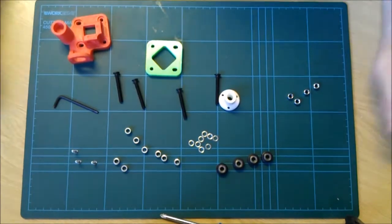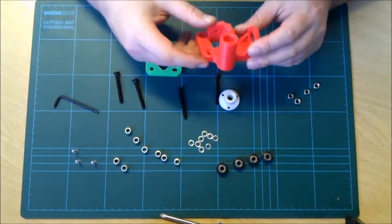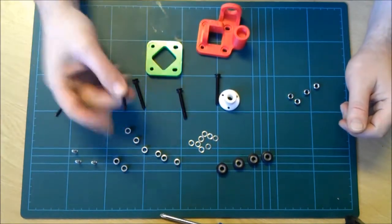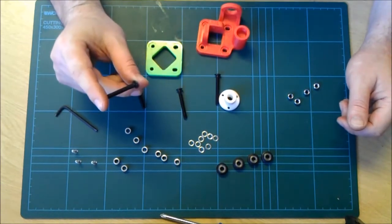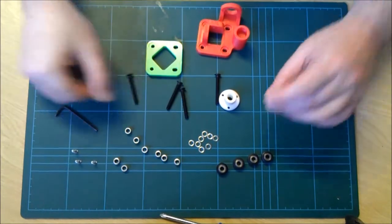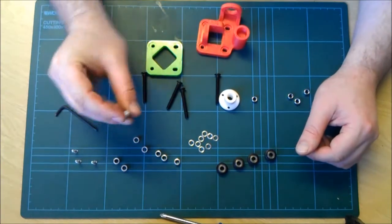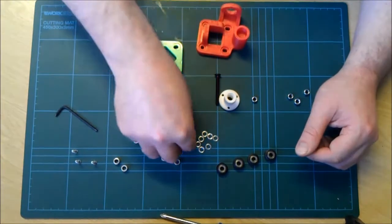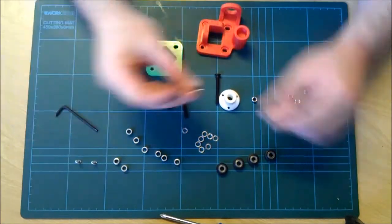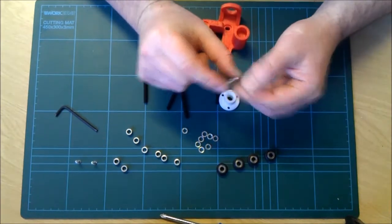Now we're going to attempt to build the X End bearing side for the Lautr3k 3D printer without belts build. Okay, this you need again some low profile M5 nuts, 40mm long M5 bolts, the mini V wheel slot wheels, 8 1/4 inch spacers, and 8 1mm washers or spacers, and I've got 3 M3 screws or bolts, 10mm long.